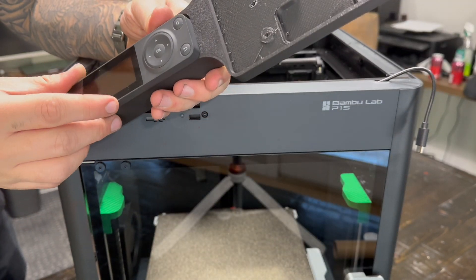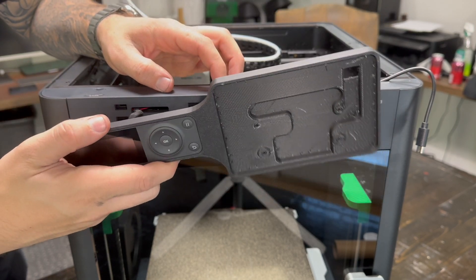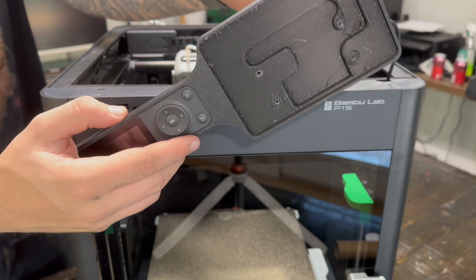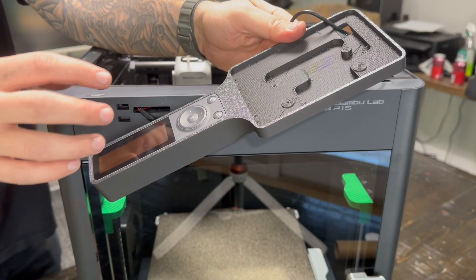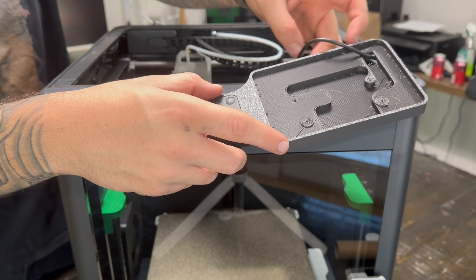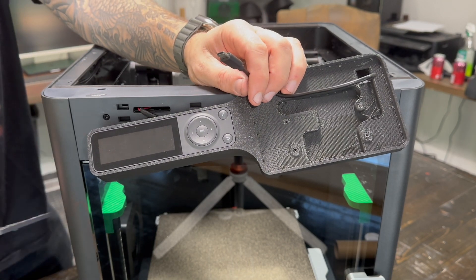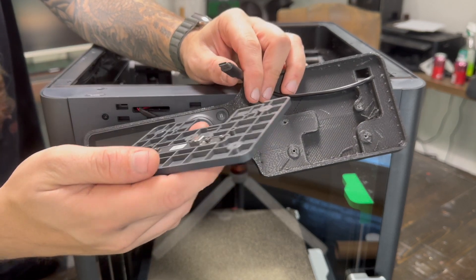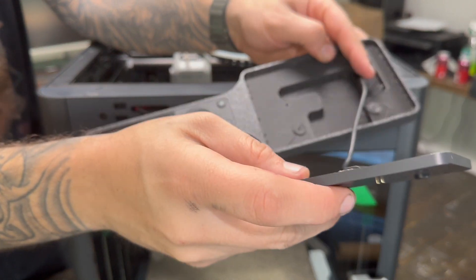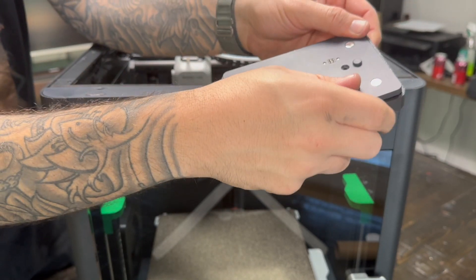Thanks for watching me struggle, everyone. So now this is just going to be a perfect fit. After I have the screen put on, we're going to run our wire through. What I strongly recommend is taking the screws that came with the Panda Touch and running them through to create the threads prior to — it will make your life a lot easier. With PLA, it's soft enough where it'll create its own threads. Now we're going to take our USB Type-C, plug it into our base plate, and then work our wires around and get it pushed on, then screw it down.